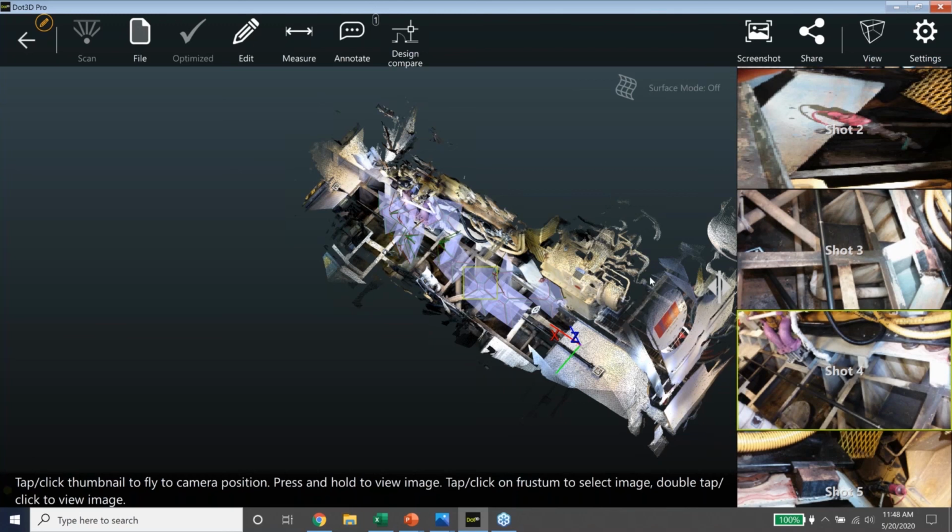These scale bars, you can make your own, or you can buy a kit from us or from Brunson. The Brunson one is accurate to plus or minus a millimeter. That's the spec over, I think, 5 meters. It's very, very tight. These are made of Invar rods. They change very little with temperature. It's really a good solution. But not always, you've got to carry them around, and the kit is heavy.